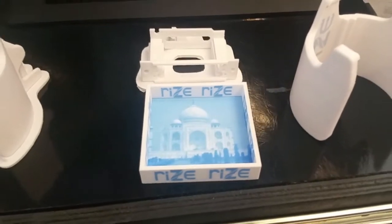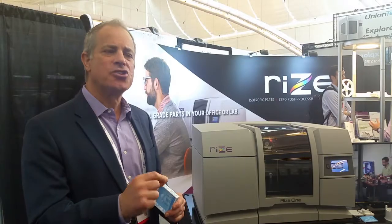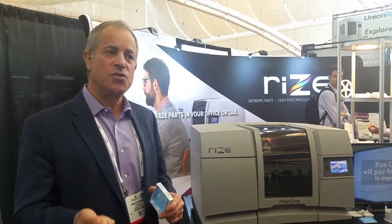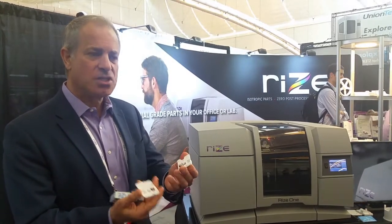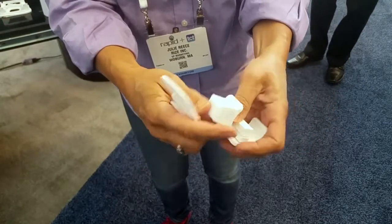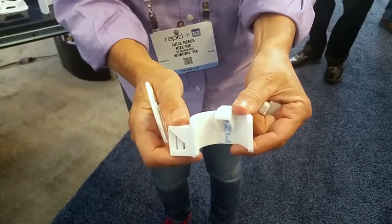But to solve the limitations of today's thermoplastic printers, we're jetting with a very high resolution industrial jet head, 300 dpi, 3 to 7 picoliter drops, voxel by voxel in between each layer. Now that solves a few of the problems. It allows the product to have release between the support and the model, making virtually zero post-processing. And if you look at our video, you'll see it takes what might be 3 hours in a sodium hydroxide tank with another technology, down to 25 seconds right at a conference room popping off the supports.